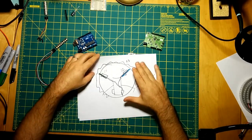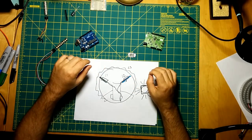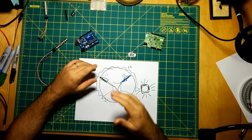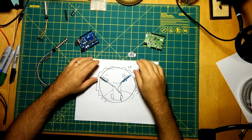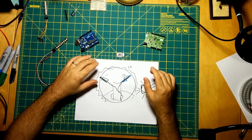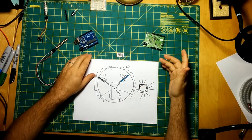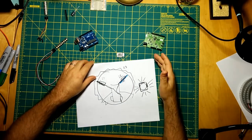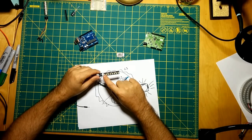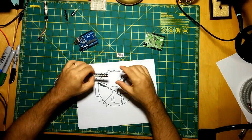And again, I think that you could ultimately make this entire thing, let's say you didn't want the big LED ring, and you just wanted it for the FAR compliance. I haven't run the numbers on it, but I think that you could get the chip, and we could even do it without a screen. You could just have this sort of minimalist version of it, where you just have the controller board and your battery. Most people have these batteries just lying around, and maybe 2 or 4 LED strips on these crossbars or wherever you wanted to place them, and you could probably do it for under $30, and it would be compliant. Like I said, when you have both the white SMD and the RGB lit full, these things are ridiculously bright. So under $30 or $35, I think is kind of a bargain compared to the alternatives out there.